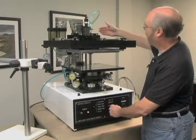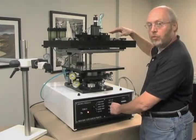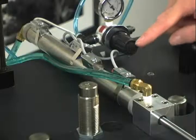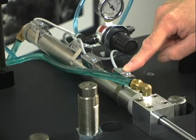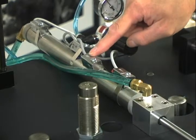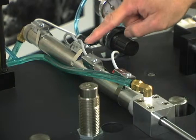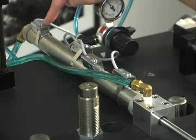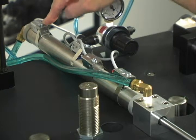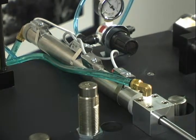I can move forward with the squeegee mechanism. This is useful for when we're setting up the limit switches in the rear. The first limit switch is for the forward distance, the second for the squeegee hop in the forward direction, the third for the squeegee hop in the rear direction, and finally the away switch. By adjusting the four switches, you can adjust the distance of travel of the print yoke for your part.